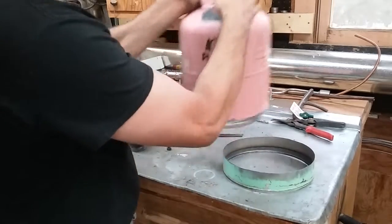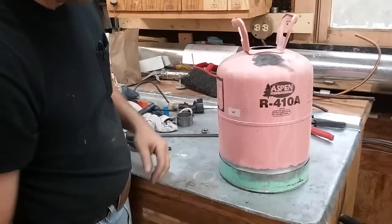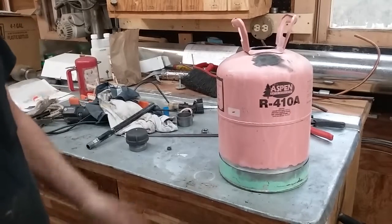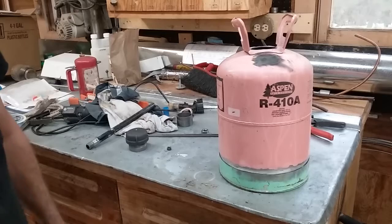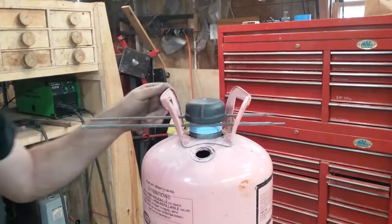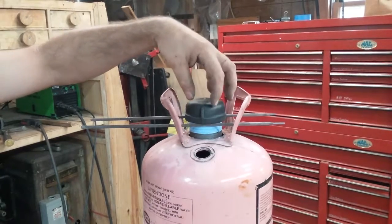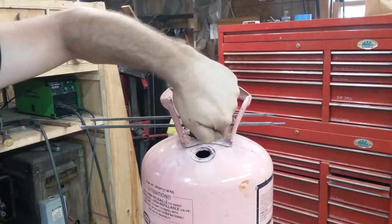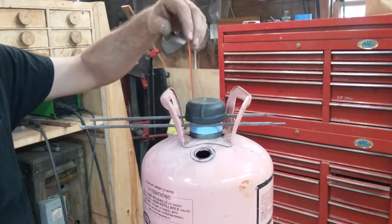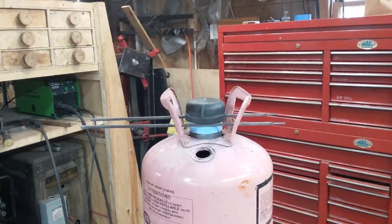The first thing I'm going to do is get over to my welding machine and weld my foot on there so this stupid thing's not flopping around. I got my little threadlet welded in there and I've got my cap sitting just loosely screwed on to my nipple. I've got some blue monster Teflon tape wrapped around those threads, so we're going to see if that will keep splatter from sticking to it, or if that's going to melt and make a god-awful mess that I regret until the end of my life.